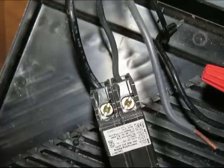One thing that was new to me when I was doing this is that I noticed all these breakers have square head screws in them. You can use a flathead screwdriver, but it doesn't work as well as a good square drive screwdriver, and you might have to buy a square drive screwdriver. But it works much better and much more positive tightening and loosening. You won't strip those little screws. You strip those screws, you'll have to buy a new breaker. So get a square drive screwdriver to do these. And they're a medium size.